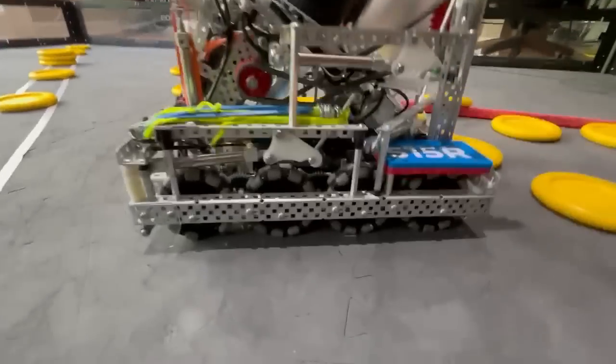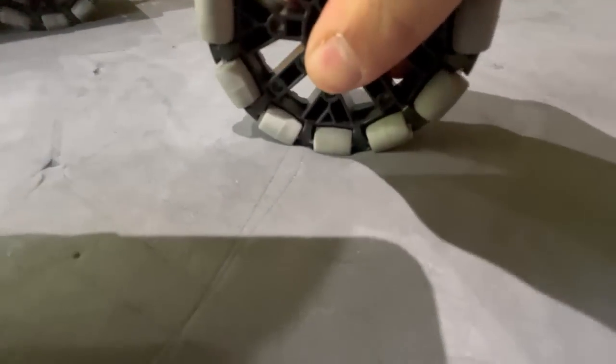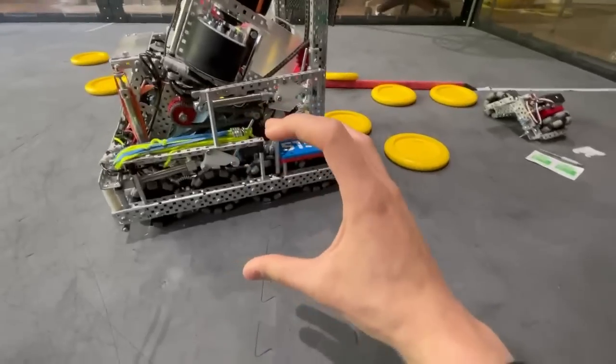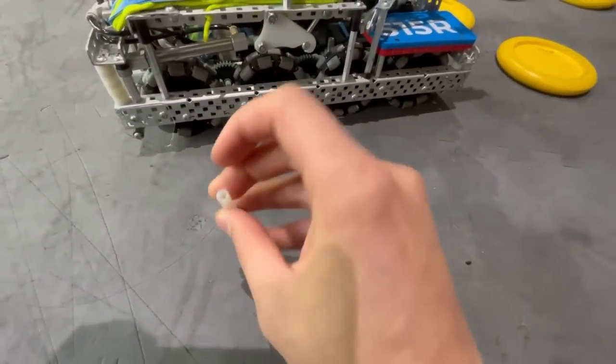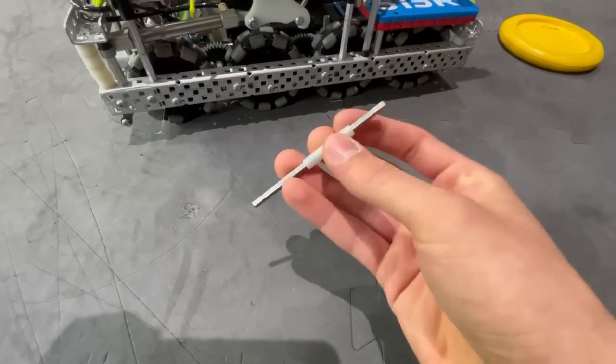Starting with the drivetrain — eight wheels is really nice. The idea behind this is that with four wheels you really sink into the tiles a lot, so with eight wheels, by spreading out that load more, you're less sunk in. The more sunk in you are, it's like driving uphill all game. To make this work we ran 450 RPM on 3.25-inch wheels, which is very close to the shaft, so we got very thin spacers from McMaster-Carr which allow it to work.